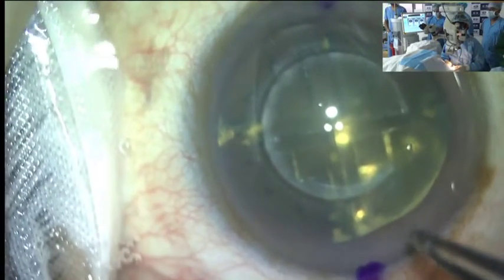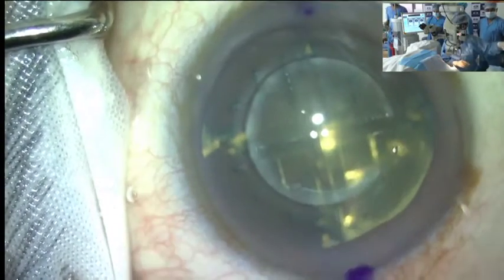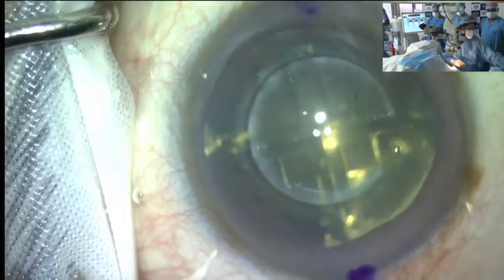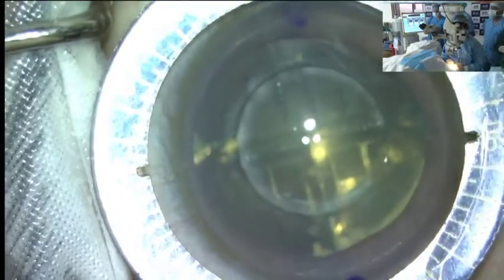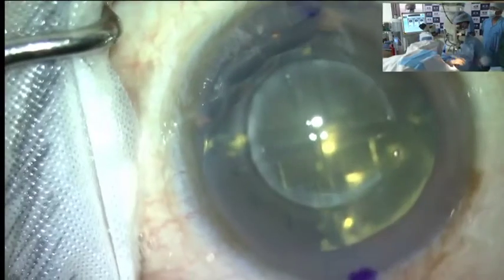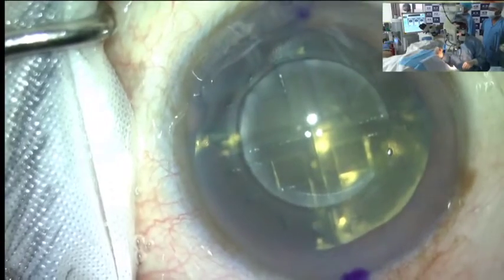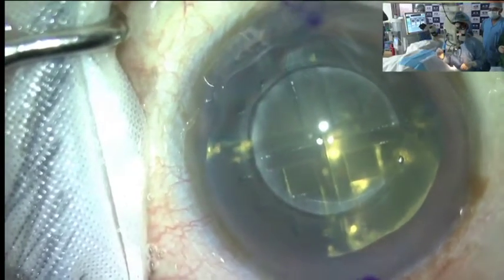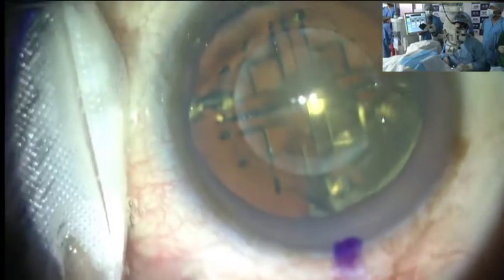There is one mark here and there is the other one. This is 0-180 that we had marked. You can see the marker, and once aligned, this is coming at 26 degrees right here — 25, 26 — coming right here and 206. So it is well aligned from that perspective. I will just put on to coaxial now because the marks are not well seen when you are not coaxial.